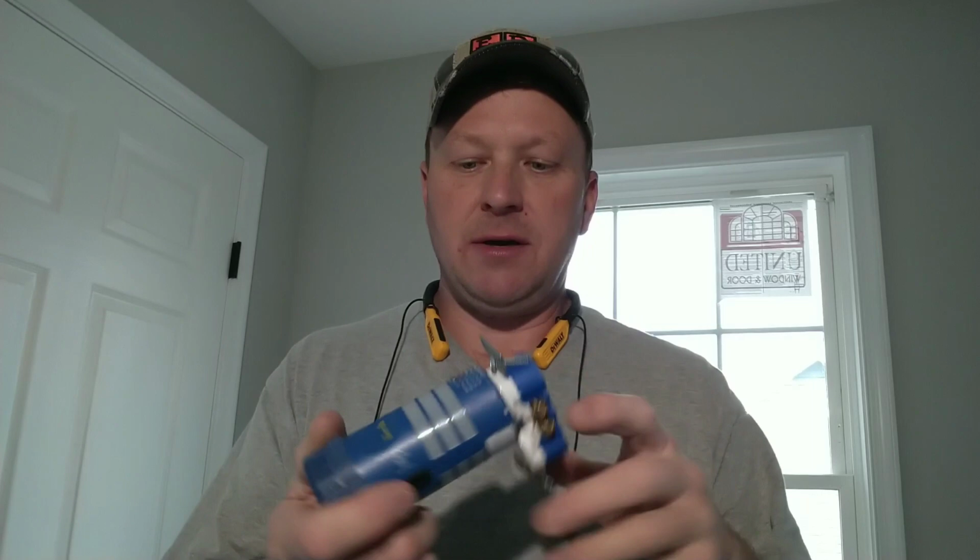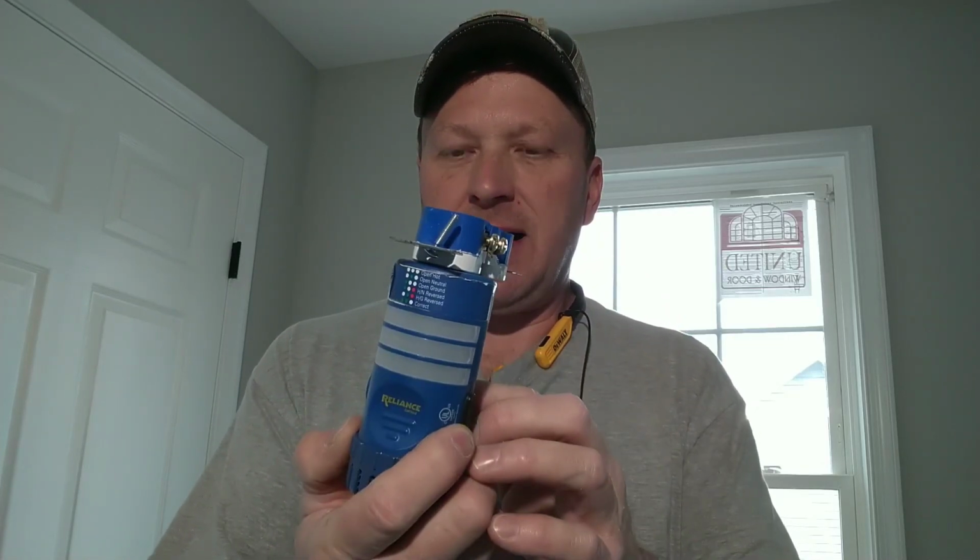And the electrical inspector actually uses one similar to this. This is Reliance. It has an audible signal. So that if I'm doing work at a distance and I'm turning breakers on trying to designate a circuit, I can hear an audible signal. I mean, I can hear this thing miles. It's super loud. It's like 120 decibel. But it also detects your polarities, if they're crossed or reversed, and it tells you if it's miswired, basically. And these actually are light bands that can be viewed from both sides.